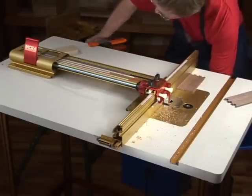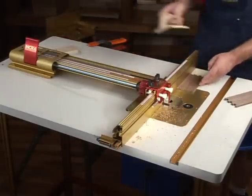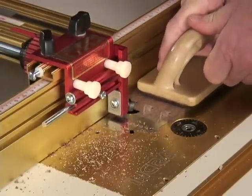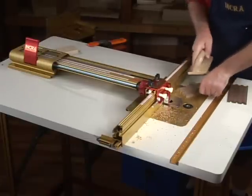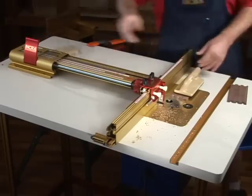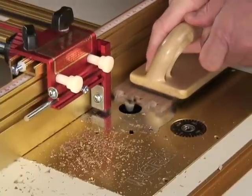Move the board away from the cutter, turn the router on, and using a good rubber-soled push block, make the cut at both ends of both boards. Move the stock into the cut until you just touch the extender. Don't force the material against the stop. Keep the same face down on both boards throughout the entire series of cuts. Move your LS from one B cut to another to complete the cuts on each of your two pin boards.